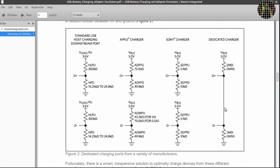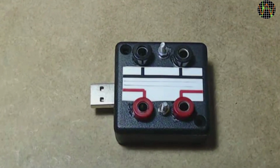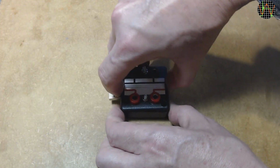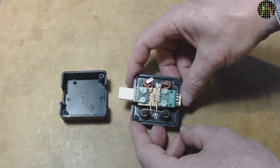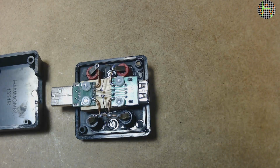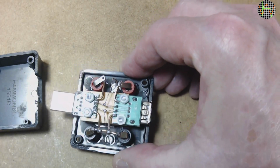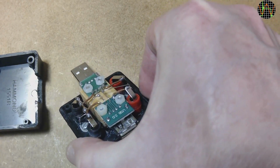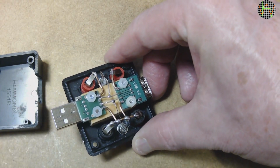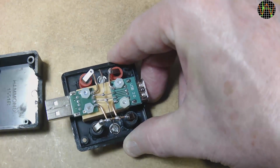While my USB testers show the voltage of the D+ and D- lines, they don't allow any direct access. For that, I decided to modify my handy little adapter you have seen in a few other videos already. Notice the new pair of screws sticking out? Those are my crude but functional terminals to access the D+ and D-. The adapter is made of 2 USB breakout boards you can buy ready from eBay, mounted on a piece of wood. You can see that the ground and D+ and D- are wired straight through from the USB socket to a USB plug. The +5 volt is not wired through to allow insertion of a multimeter for current measurement. The 2 new screws simply tap the D+ and D- wires on either side.